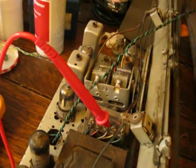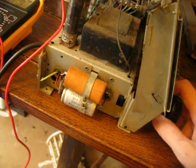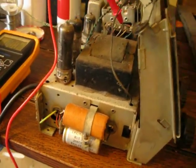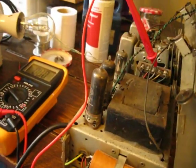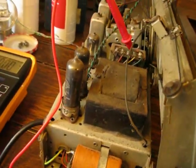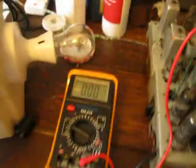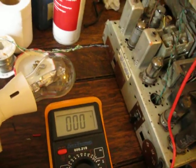What components ought I replace first? The cathode AC bypass capacitors — like the 25 microfarad one. Those will probably be leaky because they're electrolytics. The others are wax-covered paper, and I'm assuming they're okay. For example, the one I cut out from the neutral to chassis registered absolutely fine for capacitance — zero DC current.